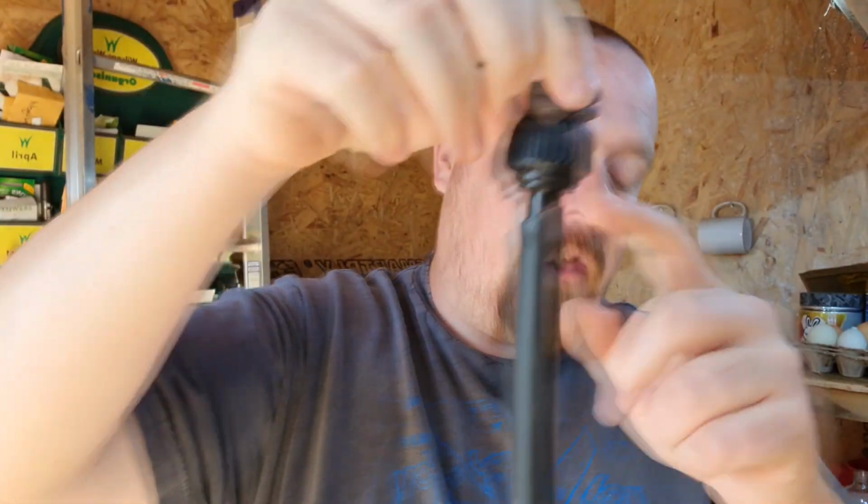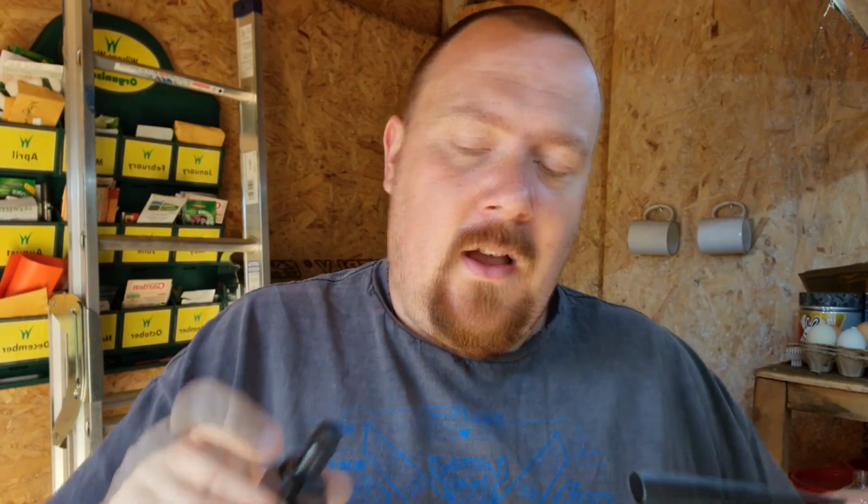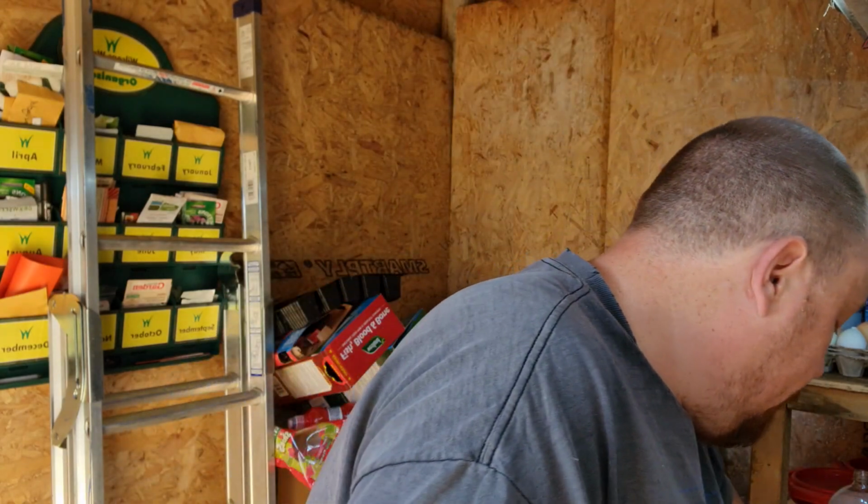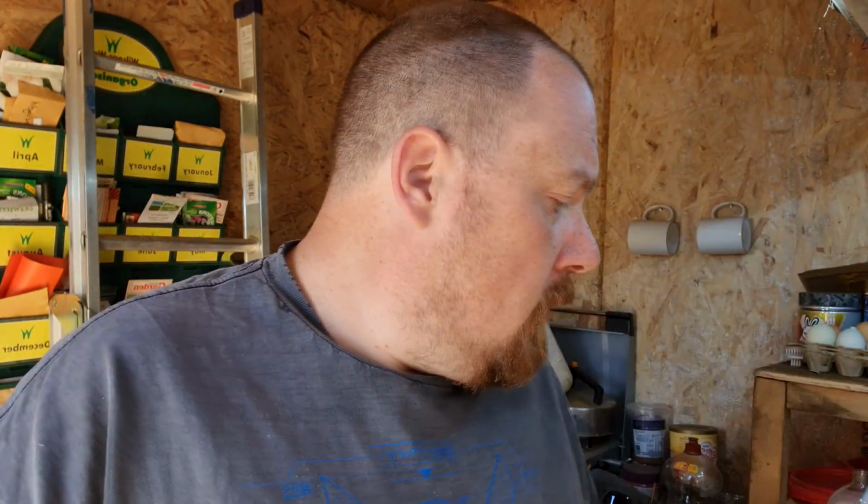Now normally what you'd do actually is you'd warm this bit of pipe up with some warm water. It'll stop it stretching the pipe. The pipe is more inclined to return back to its original diameter, sort of giving you a tighter fit on this barb. If for whatever reason you can't do that, they also sell hose clips at a very cheap price actually. I paid less for a box of 10 hose clips than I usually pay for hose clips at my automotive supplier. So order some extras, order plenty.